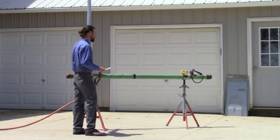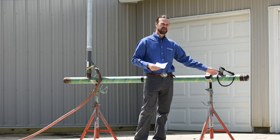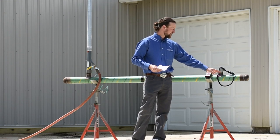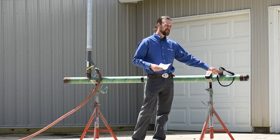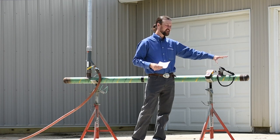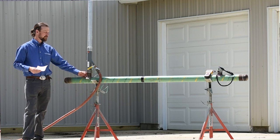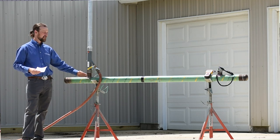We have two short stops — both would be an in-service weld put on the pipeline. This short stop here is at the end, which would be the dead end. This one here is your purging stack, where you would purge and depressurize.